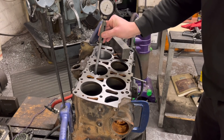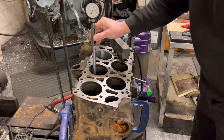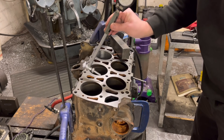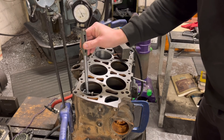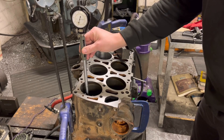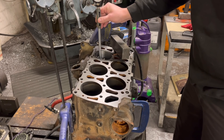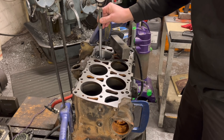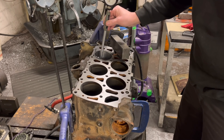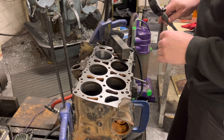So I've set this with small hand on the two, big hand on the zero, and that is 84.5 in metric. If I measure one that I haven't touched yet, you can see it goes well almost around to the one, little hand on the zero - so that is 84, what it is normally. This one here that I've honed already - I've took about five and a half thou out of that already, so I'm going to keep on plugging. I've got about another 15 thou to come out of there.